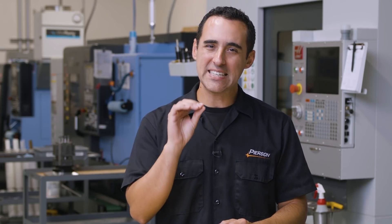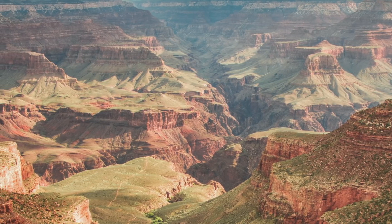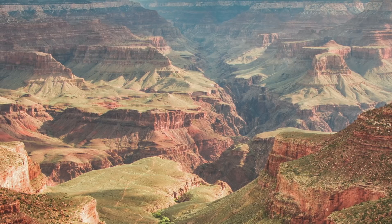Let's talk about the first one — the surface area exposed to the vacuum on the plane of the gasket. To really understand it, you have to get to the molecular level. When you look at our chuck, you'll notice it has a Blanchard ground texture. To an air molecule, this texture is like the Grand Canyon — there's plenty of surface area exposed for the vacuum chuck to act on.